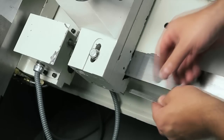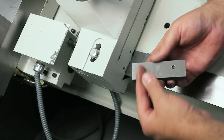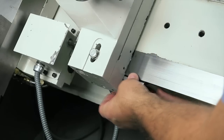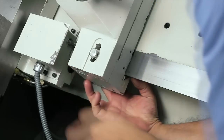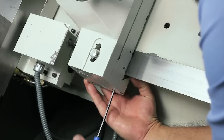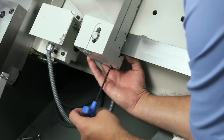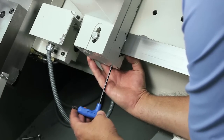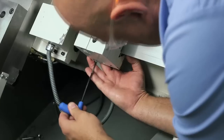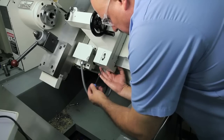Slide this plate in along the way. Just make sure you have the detents orientated the right way — they're offset a little bit to the top, that's how you want to slide it in. Slide it in, and then tighten the set screws in; you can feel it when they just start into the detent.